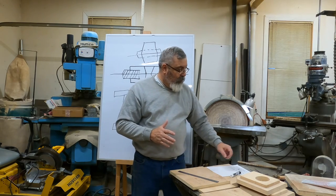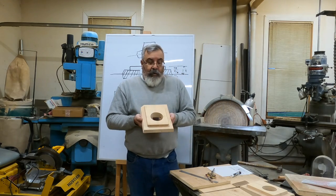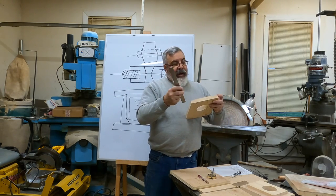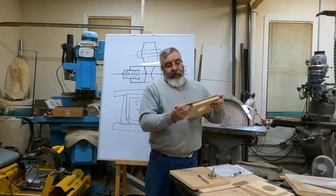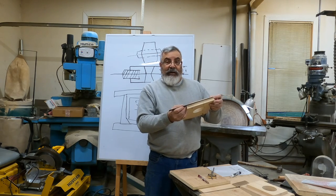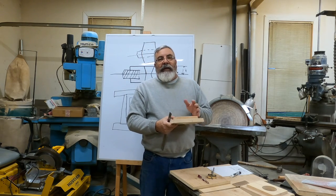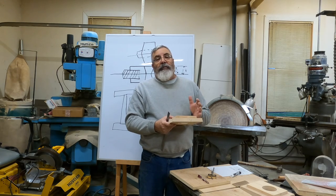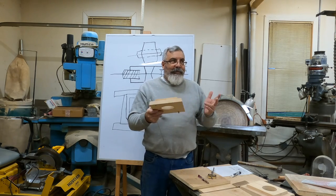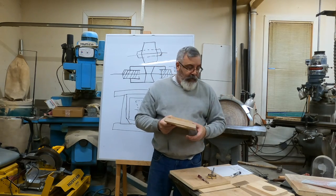And like I said, we're going to make this core box maybe around a 32nd smaller than this. I don't know if we made this, yeah, this is at one, it was a 16th, so it's 7 5/16. So we'll probably make this a 32nd lighter, so 7 9/32, and that gives me a 64th per side. And that's going to be plenty. It'll probably fit perfect once you mold it. If it's got a little tiny slot, like I said, it's going to be a 64th, which is like 16 thousandths of an inch. That's nothing, especially when we've got an eighth inch finish all the way around this thing, all right?